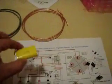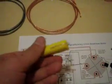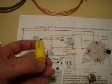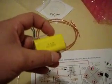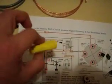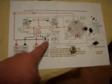You have your capacitor. This capacitor is right there. Now, this capacitor is actually an AC capacitor, so it doesn't matter which way you connect it. In here, it does show a positive and negative connection, but that doesn't really matter because this is an AC capacitor. Whichever way you connect it, it's not going to matter. It's a 10J 250 volt capacitor. I don't know what the 10 stands for. Never mind. Don't worry about it, connect it one way or the other and it's going to work. Most components you can connect no matter which way.